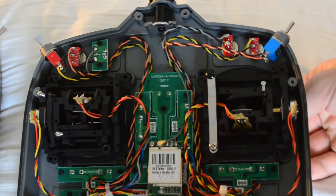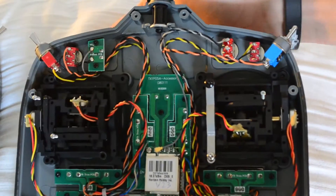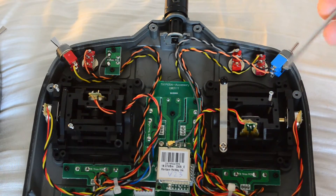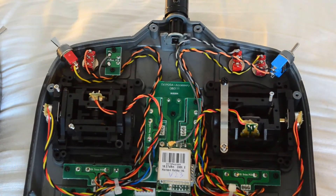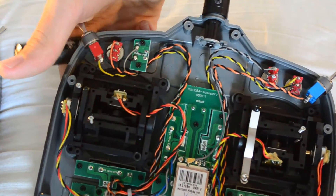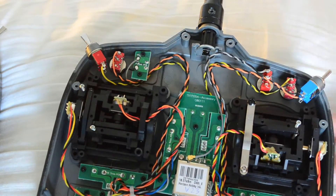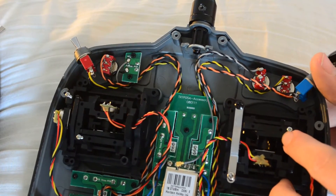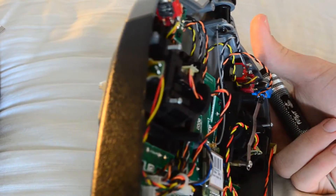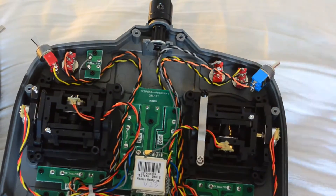So these are our gimbals, and if I actually move the sticks on this side, you can see them moving left and right and up and down. The way that you adjust them is you've got two screws right here and right here. This screw is for the elevator, or whatever you have this stick set to, and this screw right here is for adjusting the aileron control. On this side it's a little bit different — you've got this screw for adjusting rudder, and this band right here is what's creating pressure on the throttle, pressing in on this little band on the back, creating friction.